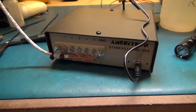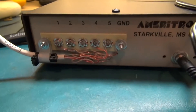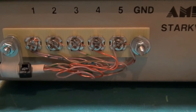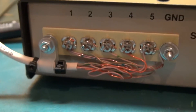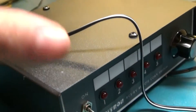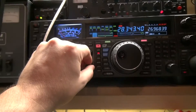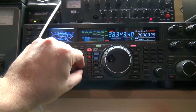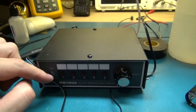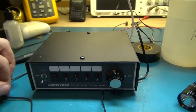I have the switch box hooked up according to my legend. It's all wired up — two redundant ground wires and two redundant channel one wires, just in case something happens. I'm going to turn the radio up on 10 meters. It's quiet right now because when you have the switch off, all antennas are grounded — remember how we set it up that way in the previous video.